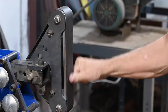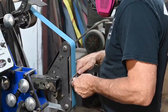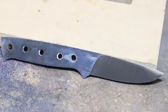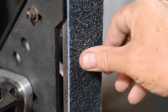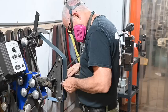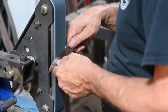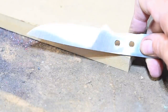We'll use a rotary grinding attachment which minimizes belt bump and helps give you a nice even finish even at relatively high grits. Once all the lines are perfect and everything's nice and smooth, he'll use this fine surface conditioning belt to lay in a really even texture. Depending on the knife he might use either a fine or even a super fine belt. These are great for giving you a nice finish so you don't have to spend hours on end hand sanding. I blurred my plunge lines a little more than I intended doing this, but otherwise the effect from the conditioning belts was pretty good.